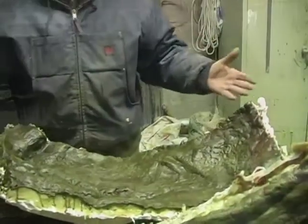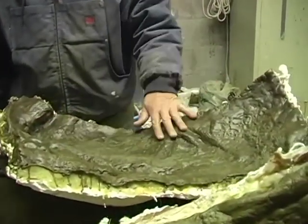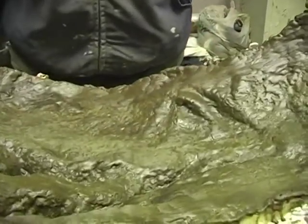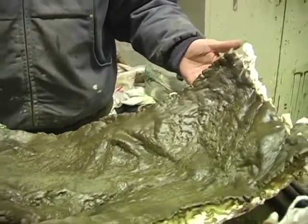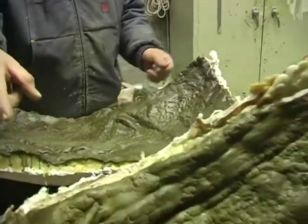So now that you've seen a mother mold section with its rubber, now you see what it's like after we paint on the wax. So it looks much like this. And what that allows us to do is to store the wax piece fully supported by the plaster mother mold, at which point we then begin the spruing process.